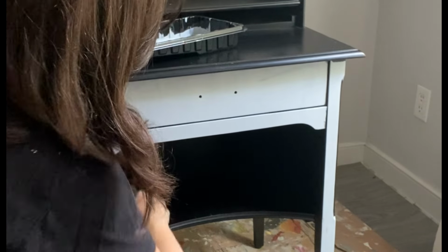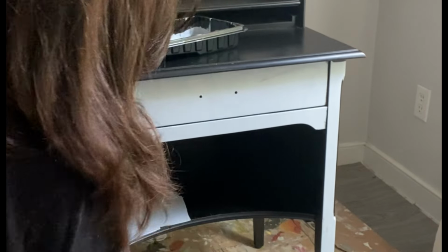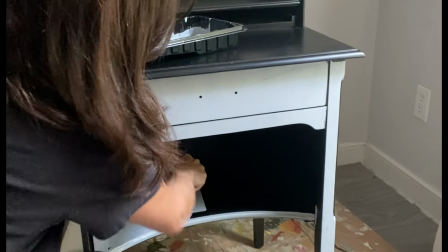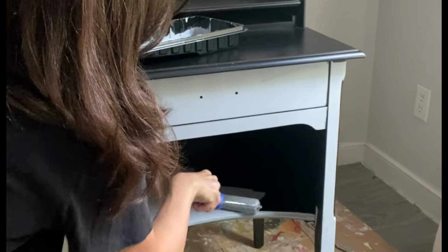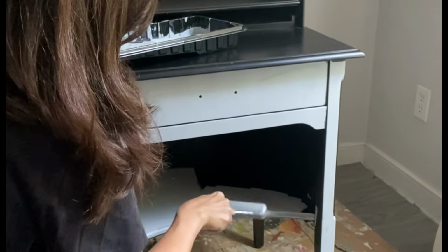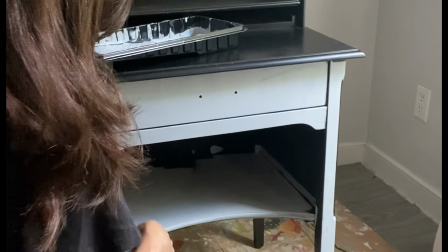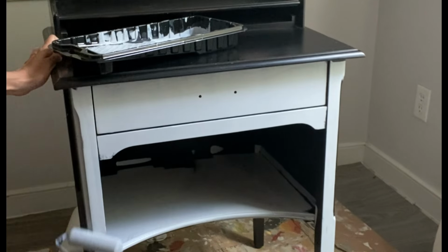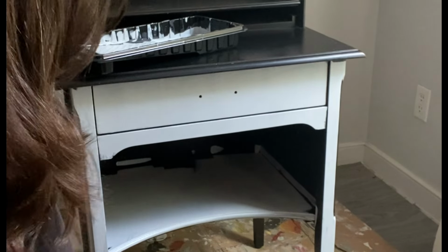Bonding Boss is not only an adhesion gripping primer, it's also a stain blocking primer. So it's really a 2-in-1, jack of all trades, get it done kind of a job. Once it's on, you wait your 24 hours before you begin to paint and you are good to go. I like to use a foam throwaway brush so that when I'm finished applying my color of Boss, whether it be gray, clear, or white, I can just throw it in the bin and not worry about washing it down the drain.